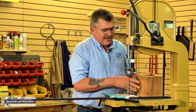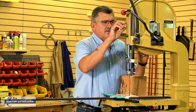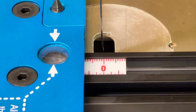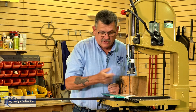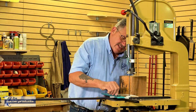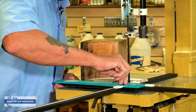Now I want to adjust my tape because we've got a six-inch blank here roughly. We're going to bring our tape over so that the zero is right behind the blade. That way, whatever shows up here — this one's showing three inches — tells me I'm going to be able to cut a six-inch blank. We'll just adjust that in a little bit better and snug that up.